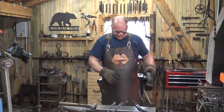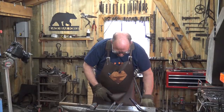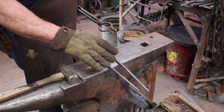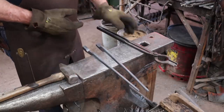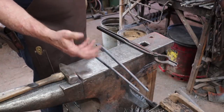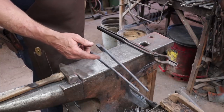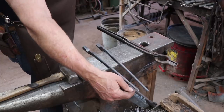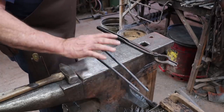We've got the reins pretty much drawn out. They're just not quite the right length, but they look like the same width, and I think that's more important - that they have the same amount of mass so they grip evenly, same strength, same springiness. Once they cool, I'll just trim that little end off. I may do a little grinding just to take care of the little burr from cutting it.